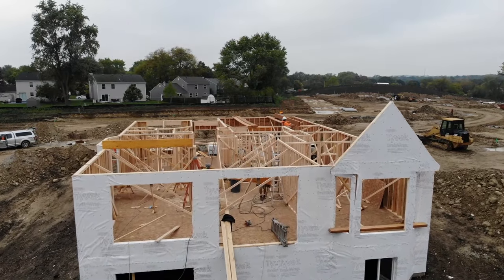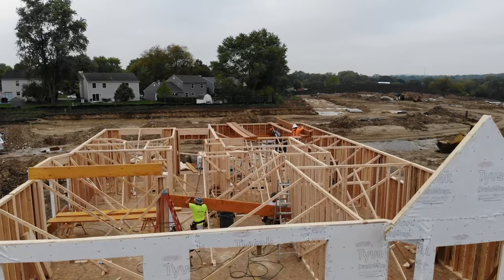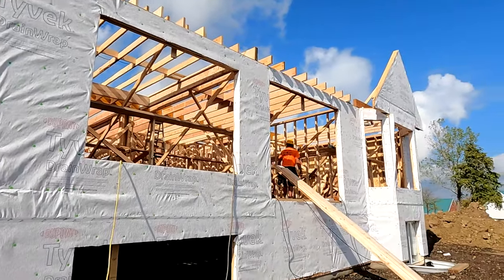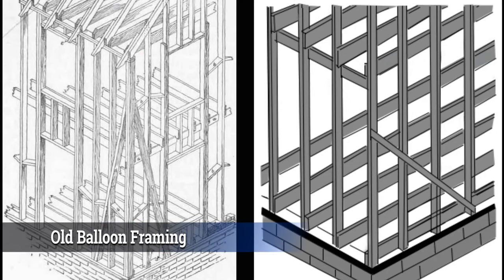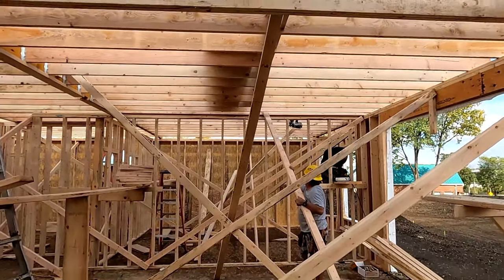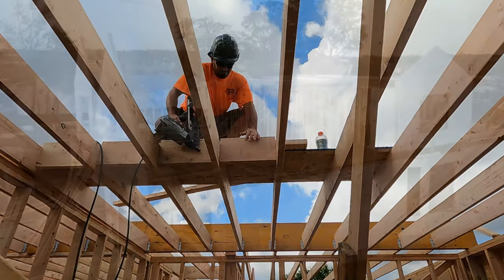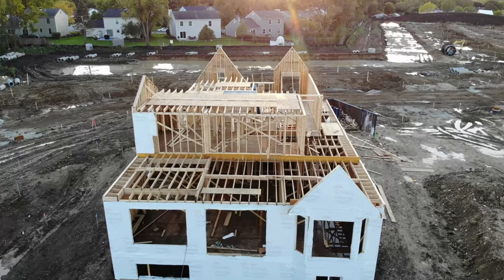Where we've got some single-story space and some two-story space, we will have some construction of rafters going off the first floor walls, but we're also going to have a second floor section that's put up. In past times we used to do balloon framing where they put a wall maybe 20 feet tall and let in the joist, but what we do now is called platform framing — the first floor walls go up, the floor joists come in and sit right on top of those wall plates, the second floor is installed, and then they build the second floor walls on top of that.